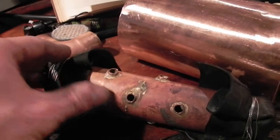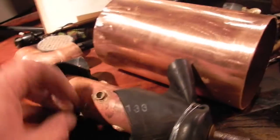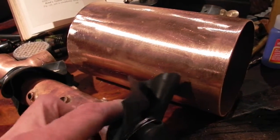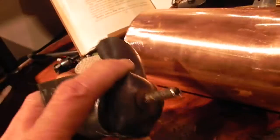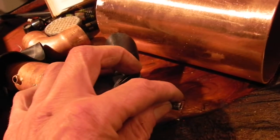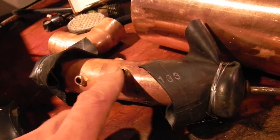I've got a bit of rampant solder here and here, which isn't a problem. Basically I took very, very thick soap and water and coated the end here with rubber, totally sealing it as much as I could. It doesn't have to be completely sealed, just enough to get 10 or 15 pounds per square inch in there. Then I took a motorcycle inner tube, removed the valve, and stuck a silicone hose on here.